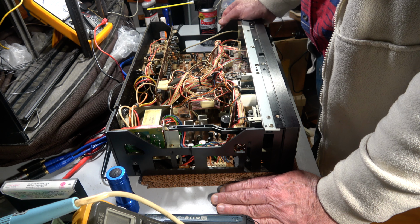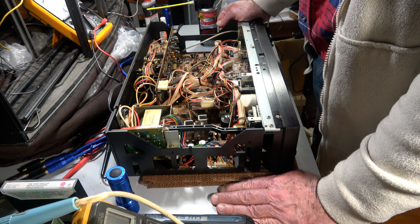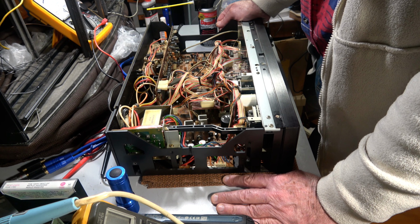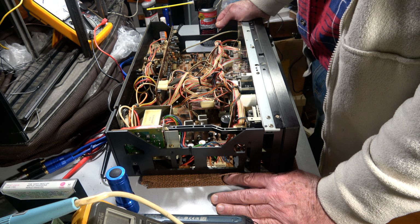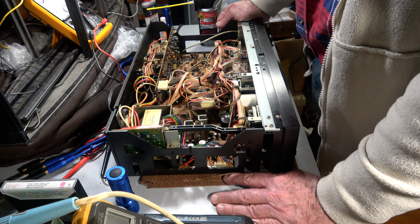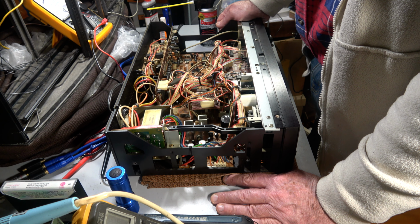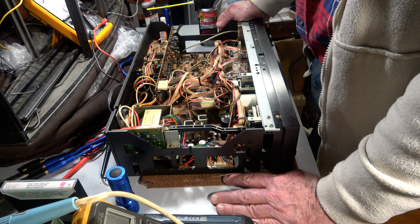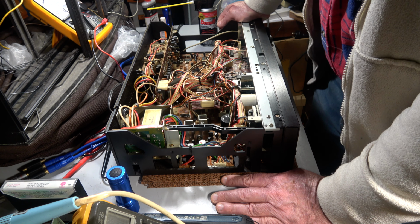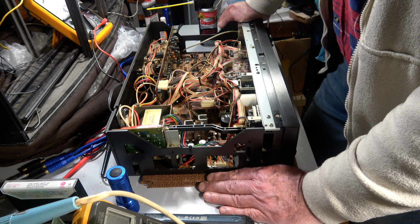The only thing I've bought recently that's 115 volt is, believe it or not, a demagnetizer. It seems the only people in the world that have used bulk erasers are the Yanks. They're nowhere else to be found in the world on eBay, but from the US there's lots of them. So I bought one, but I had to buy a 240 volt to 120 volt transformer. To my surprise, they're actually really cheap. I paid $59 Australian for a 1 kilowatt step-down transformer sent locally. It's obviously not a real transformer inside. It's all electronic, I assume, which is why it's so cheap. But it's meant to be pure sine wave, so why not?